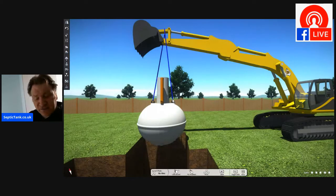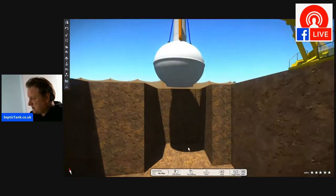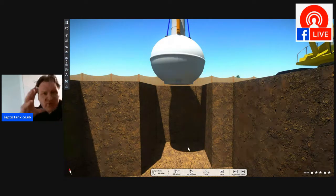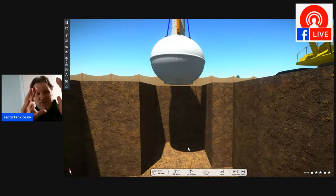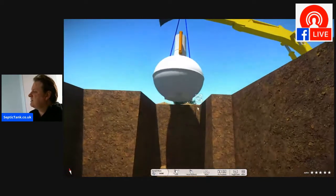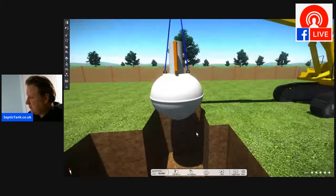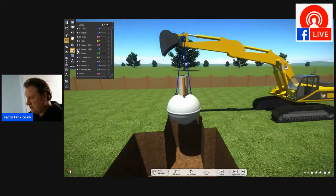So literally lift the septic tank up from the ground and then get the driver to lift it in place. This is the hole underneath the tank. Once you've lifted it up, it'll rock left and right, a bit like a pendulum, but just wait for it to settle down. Once it's done that, that's what it looks like from down below. So don't get below the tank, but once you've done that, you can then lower the tank into the hole.